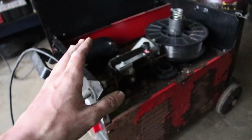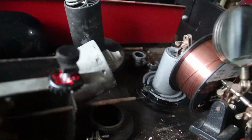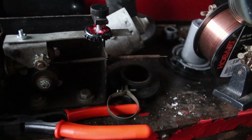Make sure that everything's tuned in properly. So, a little bit of good old-fashioned creativity and ingenuity. I'm going to get the small roll that's not meant for my welder. I'm gonna use this thing. Disconnect one of the clamps. Scoot this thing over, make some room there. It's got a little stand. Use the clamps to keep it still so it doesn't fall over. And it should spool on that just fine, I would think. Alright, got that clamped on the other side. Let's see if we can't make it work. How's that for jimmy rigging? Things should pivot just perfect. Lined up. I guess we'll see now.